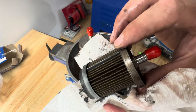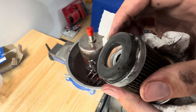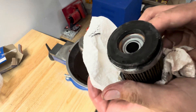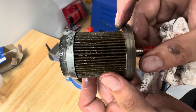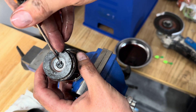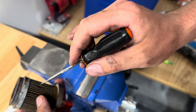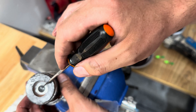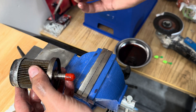There's nothing that's going to harm it, but it's better to filter it through. This magnet looks like it's glued on there — it feels like quite a strong magnet. If you could get this off and get the glue off, it'd actually be a nice magnet to have in your shop. There is a pressure relief valve right here. If you see that, it is a pressure activated relief valve. If there is enough of a clog to warrant a drop in pressure from this media getting clogged, that would bypass and open this — there's a spring in there. The pressure would push that open and it would flow just the regular fluid through one barb and directly the other, hence bypassing the filter.